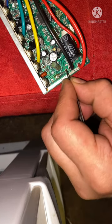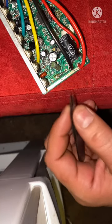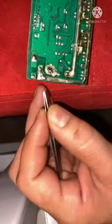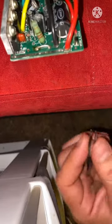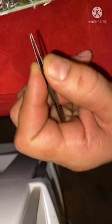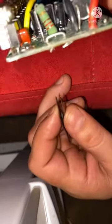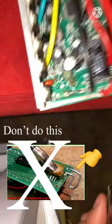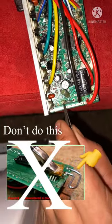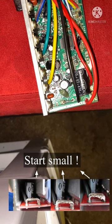If it doesn't meet your needs, go all out — solder the whole thing, double it up, thicken it up. Or like I did, just add a piece of wire from here to here. Either way it doesn't matter — you can add a wire or just thicken it up. But start off with half, because you're gonna see a big difference.